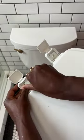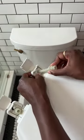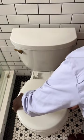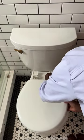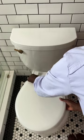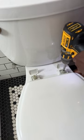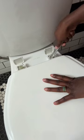It comes with all the nuts and bolts that you need. You stick those long things in the holes — the long parts go into the hole of your toilet. Just adjust it and make sure it's fitting properly front to back, then you're going to want to drill it down. There's a washer underneath that you have to hold while you drill it down — that's a really important step.